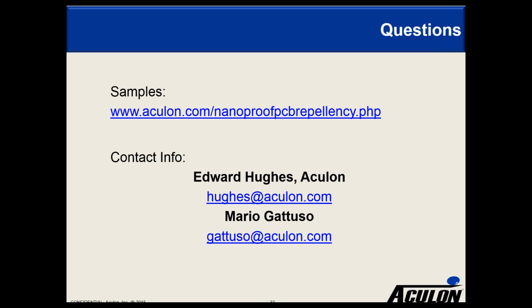How do you test or check whether the coating is on the surface? That's why we formulated with a UV tracer. It fluoresces blue under 365 nanometer light. We used a small UV lamp in lab, and it enables an easy inspection of how well you coated your surface. And I think, Josh, these UV lamps are pretty inexpensive, right? Yeah, around $200. So it's a fairly easy test.